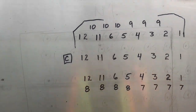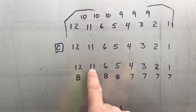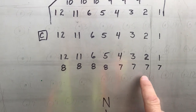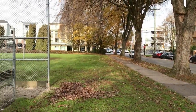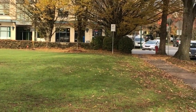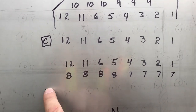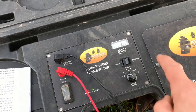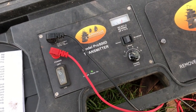I have an idea where I'm going here. Here's where I am right now — the controller. I've actually found number 12, so I'm going to be looking for the valve that operates number 11. The main line goes along here, so there should be valves all the way along here. I'm not sure where the valves would be for seven and eight, but I found the one in the corner. It shouldn't be too difficult to find, so I'm just going to trace the wire and follow it to find 11 and the rest after that.